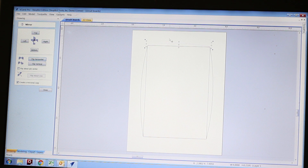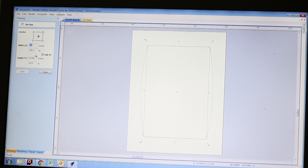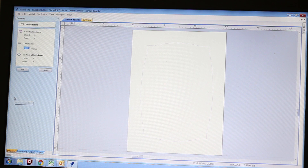When you make copies like this you can grab the new shape by the endpoint of the line and drag that endpoint over to the corner of another shape to set it in place. What I'm doing now is just scaling the length of each of these arc segments so that I have about an inch left over at the corners that will still be exactly the size of the board. With the trimming tool I can trim away the excess straight vectors and then join them all together into one continuous vector shape.